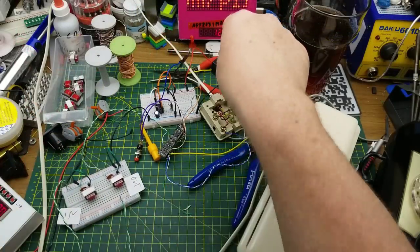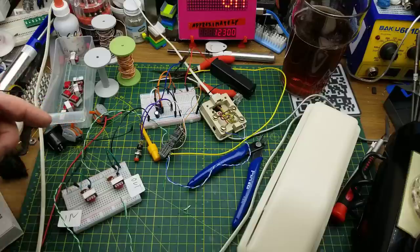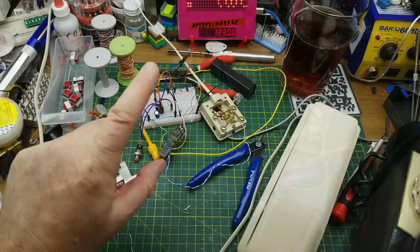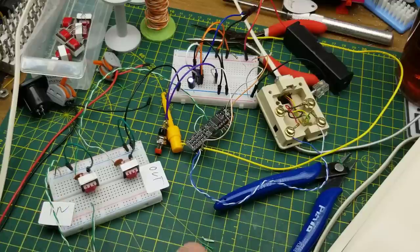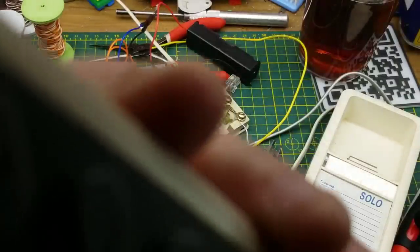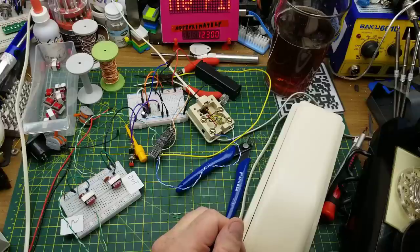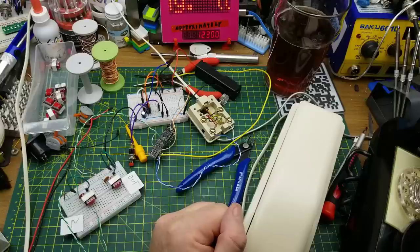So that's a win. I just need to not use a digital power supply; I need one with an analog regulator. I can add that when I finally put this in a project box. You may be getting the impression that I'm not going to put this in a project box today — and you'd be right. The only other thing to try is moving the audio connection to an output of my audio interface and seeing if we can send audio through this. I think this thing does everything I wanted it to do — excellent.